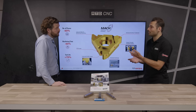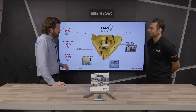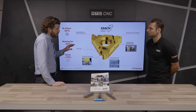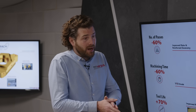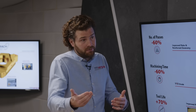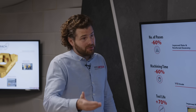So if you're taking deeper depth of cut and there's more stress on the insert, doesn't that affect your tool life negatively? No, because of the way we've designed it, it's actually a much better tool life with this insert because it's in-cut less. It's not taking as much constant material out time and time again taking more passes. So because you're reducing the passes, we're actually able to increase your tool life.